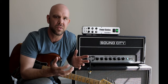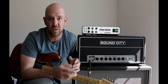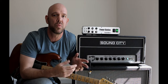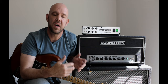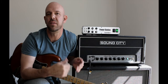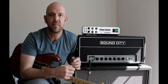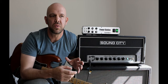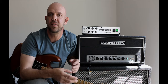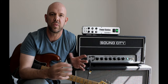It's just electrons and magnetic field stuff rattling around together and we get to hear the result because we're inducing it by using sound reproduction equipment at high volumes. What's happening is that the output transformer is vibrating in sympathy with the magnetic field that it's producing. As you get your guitar closer to the amplifier — whether it's being heavily attenuated by the power station or played at loud volume — you're inducing this magnetic feedback loop. Your pickups are literally picking up on the magnetic field and the vibration radiating out from the transformer, thus producing this squeal of feedback.